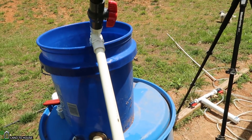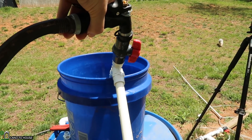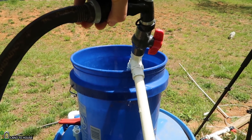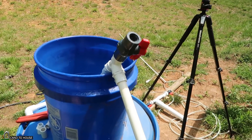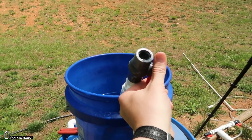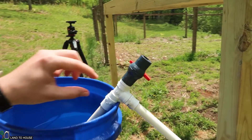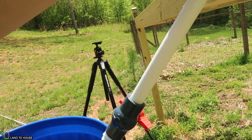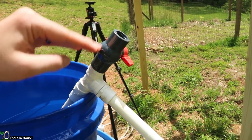There are a couple reasons that you have to fill from the very top here. The ram pump requires there to be no air bubbles in the system. If there are air bubbles, it's not going to work. By filling here at the very top, you can ensure no air. The water is now all the way to the top so it flows out here. I'm going to go ahead and close this valve off. One thing that might really help you is to add an extension pipe here so that when this closes, it would come up from this piece. So all of this pipe would be filled with water to ensure that there is absolutely no air stuck below this piece.